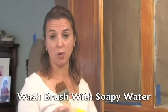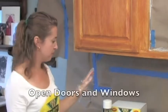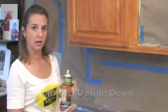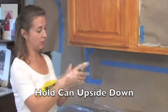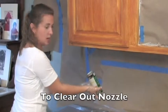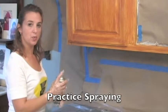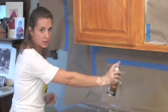If you want to save your brush, you can now wash it with warm water and soap. Our doors are dry and we'd like to begin spraying. First we want to open some doors and windows for ventilation. Shake the can for one minute. We're going to clear out the nozzle on the spray can by holding the can upside down in front of your paper and just press the nozzle until clear air comes out. Do some practice runs with your spray — begin moving your arm in motion before you press the nozzle.